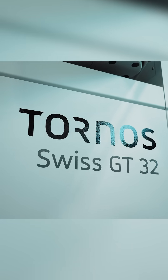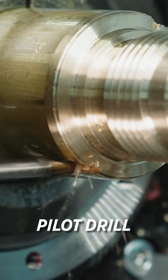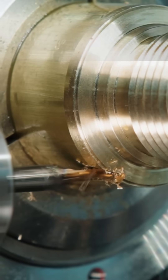So the trick is we're actually gonna put the holes in first. You have to get material that's just a little bit bigger so you can fit these tools in before you mill the hexagon. And then we're gonna mill the hexagon.